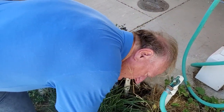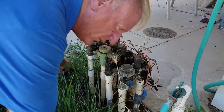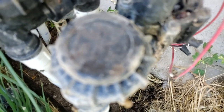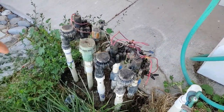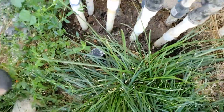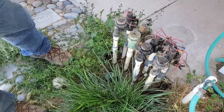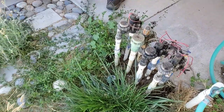So I'm listening for water bleeding through the valves — it's kind of like a hissing sound. It appears to be this one here. At the moment it seems like that's the only one. And then on this system back here we're running Hunter PGPs, the rotor sprays. You'll probably not find those clogged too often because the ports on them are so large that whatever debris just blows out with the water. There is a screen down inside of it, but it doesn't clog very often.